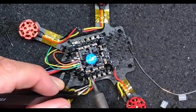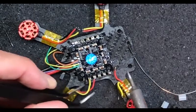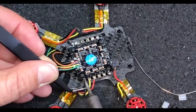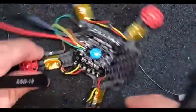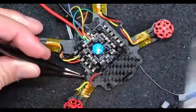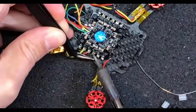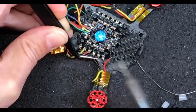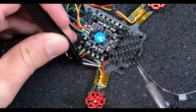Heat through the wire - that way you don't overheat the pad. If you lift one of those pads off, your board is screwed - that makes for a bad day. The other day I was building a different one and I did move one of the transistors, but it still works so fuck it.